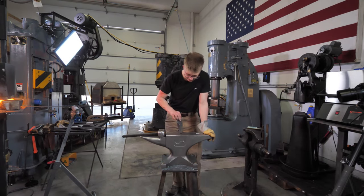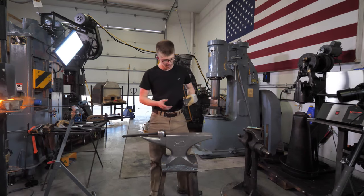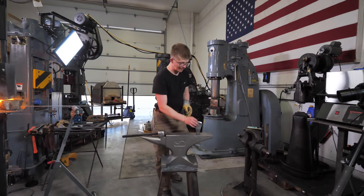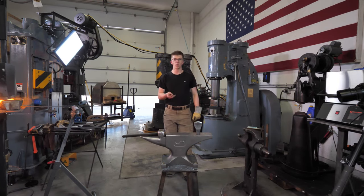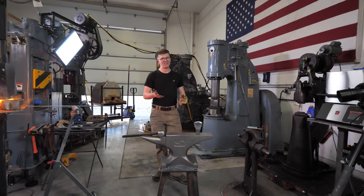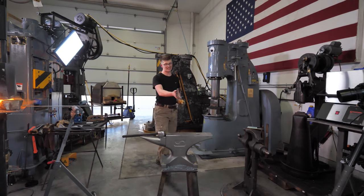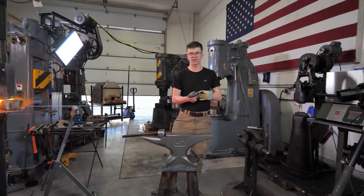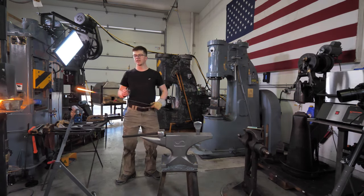This has a tapered shank on it. The reason that's tapered is just like the key holding a power hammer die in place, this gets forced into the hardy hole and it locks itself in place. Because you're working with such a limited surface area on the blade, you're able to do this, hopefully, without splitting an anvil heel. Watch me bite my tongue when this brand new anvil that we are testing splits right now. It shouldn't. But if you use a bottom fuller, which has a much wider profile, in an anvil heel, I think you'd probably end up splitting it no matter what anvil you had. So you would only do this tapered shank tool with a blade, with a hot cut. It has a rounded edge, nice and thin, and the nice thing is it doesn't rattle around.